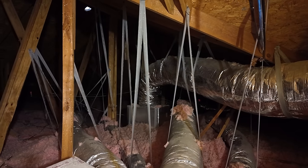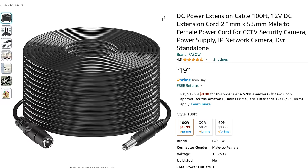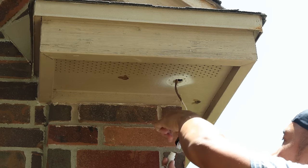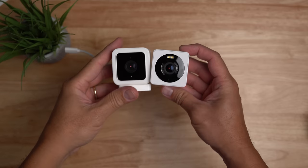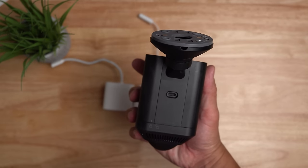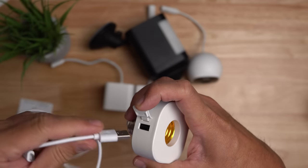So those are the different types of wired security cameras, and there's a lot to choose from. The main disadvantage of a wired setup is how to route the wiring — and some will say somebody can just unplug or cut the camera's wiring, and most of us won't have many power outlets outside. If you have attic access, the better way is to use low voltage wiring like Ethernet cables or 12-volt extension wiring or USB extension cables to power your cameras and hide them in your ceiling or wall. There are also outdoor Wi-Fi cameras like Wyze cams, Eufy outdoor, and Ring cameras powered by USB, and if there's no power outlet nearby, a good option is to tap power from an existing light fixture using a USB bulb socket.